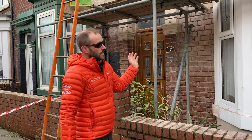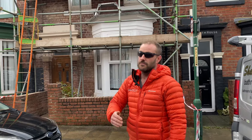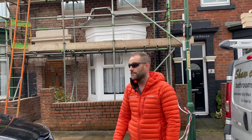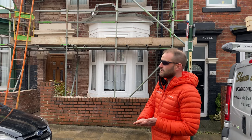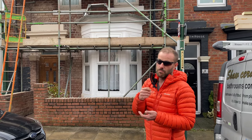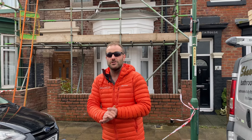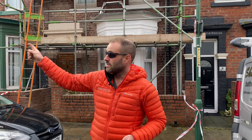So we are breaking out all of this sand and cement mortar. I'm going to wash it down because it's absolutely horrendous with the dust. I'm going to pressure wash all of that dust out of the joints. We want no dust left in the joint. When you're putting new muck in, you don't want any dust because it's not going to bond to the brickwork properly. We are going to be using NHL 5.0 lime, and that is because if you have a look down